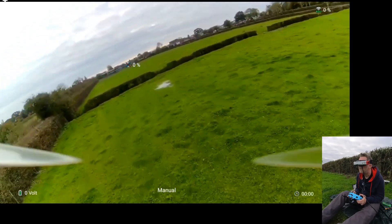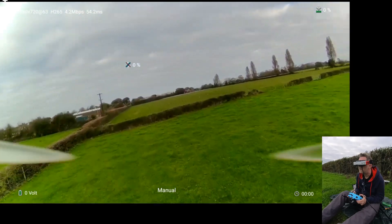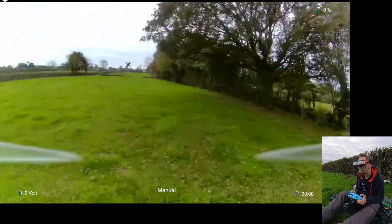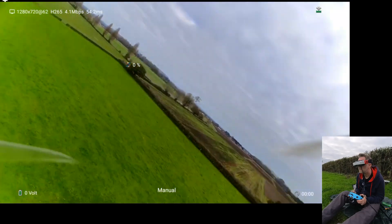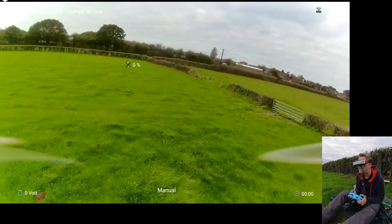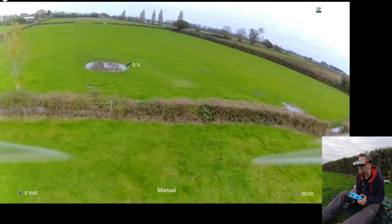I am taking it quite easy at the moment, and that's kind of on purpose because I need to know how the VTX will respond and how the quad will respond. It feels really good. I have to say I'm using this through the NVR board, and that means I've got better latency than using it on the tablet. It would be better still using that little single board computer thing whose name escapes me. This is going 720p 60. To get the best latency on the tablet it would be 720p at 120, but the NVR can only handle 60 frames a second, so we'll stay at 60.